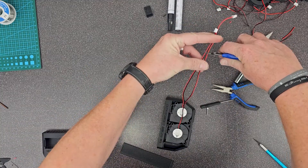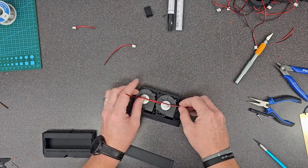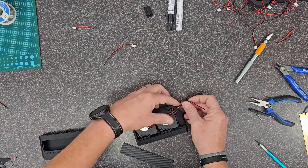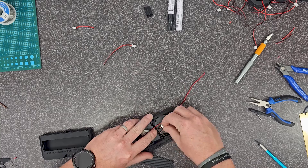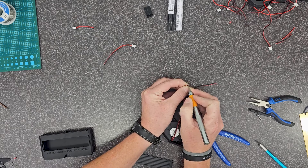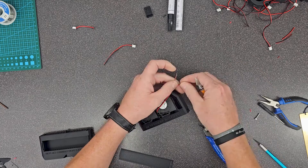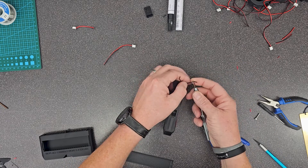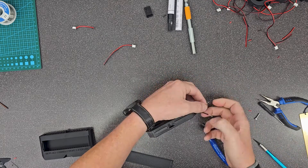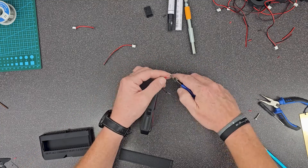Now get ready to do some wiring. Trim them down to length — these are going to be cut a little bit shorter. Flatten them out as much as you can because it's kind of tricky to get that lid on. Try to keep your wires from twisting around since they are flat wires. Cut them to length, then use your exacto knife to slide down through and strip them. If you've got a proper wire stripper it'll be a little better, but I've been doing it this way for so long. Twist them up together and cut them a bit shorter — it seems to hold them together when getting ready to solder.